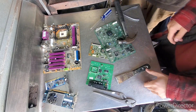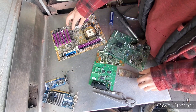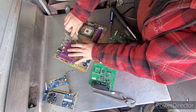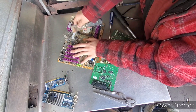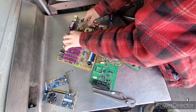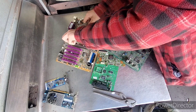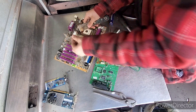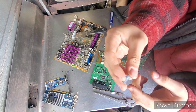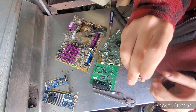I'm going to let him continue on and show you guys. There are these little IC chips here. You want to take your chisel and just scrape the edges where the prongs are, and that comes off easily. Make sure you're showing the chip up to the camera. There's your IC chip — we just scraped the sides with the chisel, it broke that part, and then we just pry the side off.